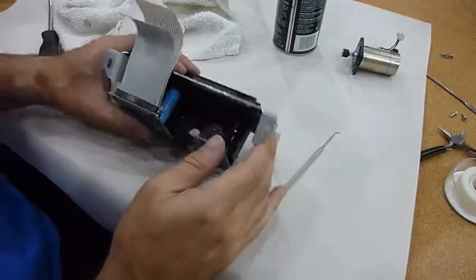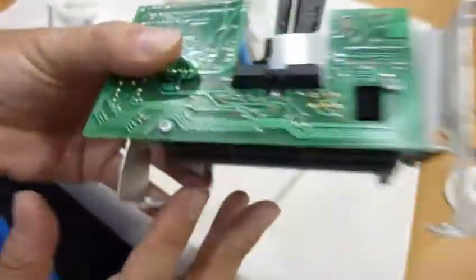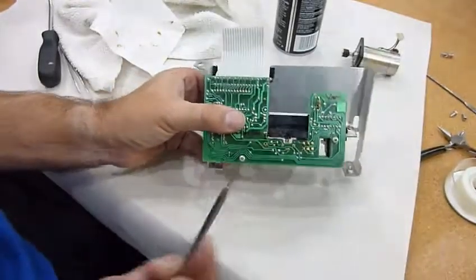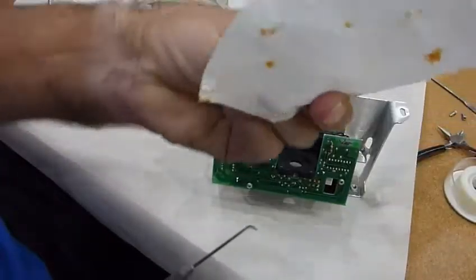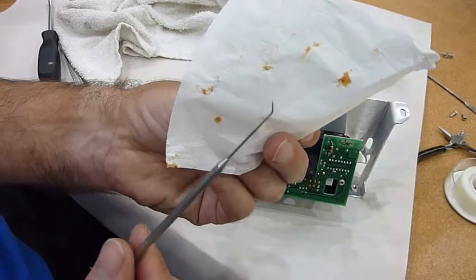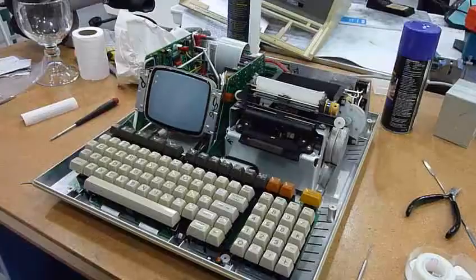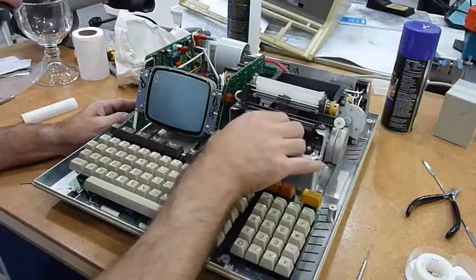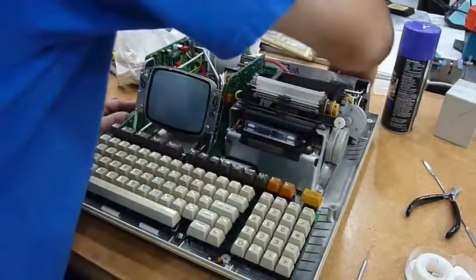I think I got it. Now there's actually a hole with nothing in it, and I relined the photo transistor to point to the hole. That was hard. Look at how much goop was in there — it's all over the place. I eventually solved it by using a toothpick and pushing it into the hole and around those spaces. Let's try again and see if it works. I'll put it back together, and hopefully that was the source of my stall problem.